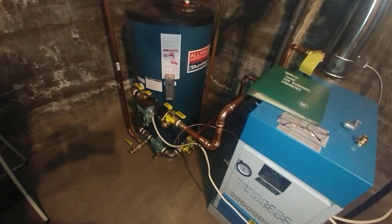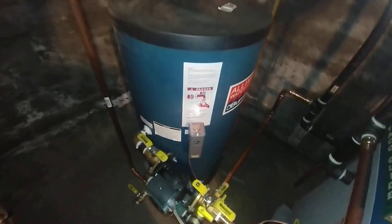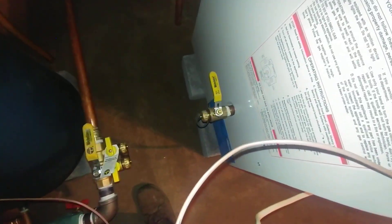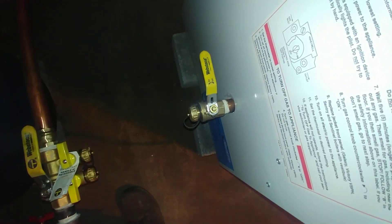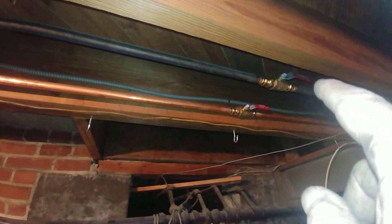We're prioritizing hot water, so as far as the boiler is concerned, this is the heat. There's a typical Honeywell control here — probably a little antiquated, but it works. I've replaced the ridiculously sized boiler drain with a full-port Webstone boiler drain. This is the cold water inlet with a drain, and three-quarter-inch pro press material here.